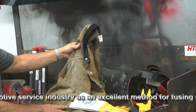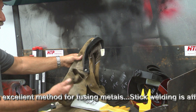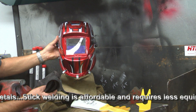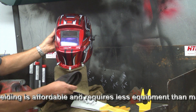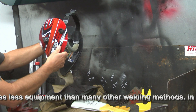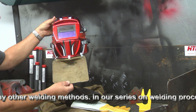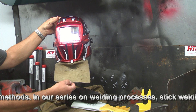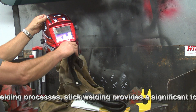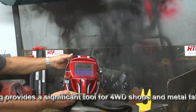Always avoid burns — make sure you wear protective gear. This leather is substantial and works really well as a barrier to hot slag and molten metal pieces. A very important element of all forms of welding is a helmet or eye shielding. In the case of stick SMAW welding, I prefer an automatic helmet that will dim to the set shade in 1/25,000th of a second. Regardless of where you secure your helmet, make sure it has ANSI approval. I also use leather off the bottom of the helmet to protect my neck, thyroid area, and collar from ultraviolet exposure. Wearing long-sleeved welding coats also protects from UV damage that results from welding processes.